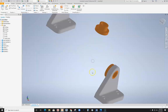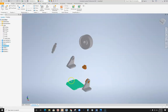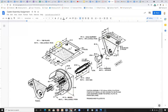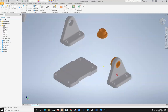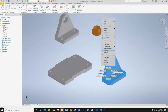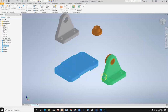The next thing I want to do is set up this object moving from this plate forward — this plate is going to be important in positioning. Jumping back to the drawing, it looks like this caster fits into this notch, this little recess on the plate. I also don't want this caster to move around anymore, so I'll take the caster, left-click on it, right-click, and hit the button for Grounded. This part is now grounded and will not move.